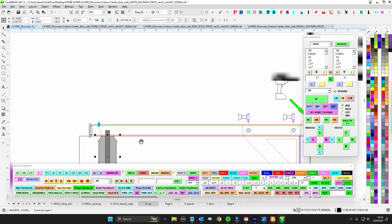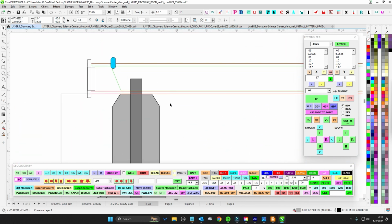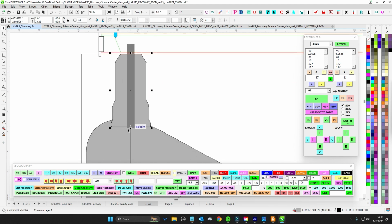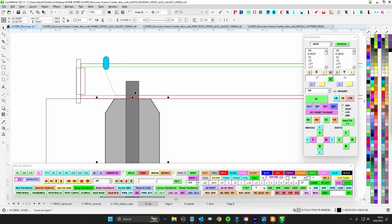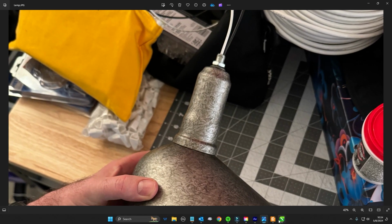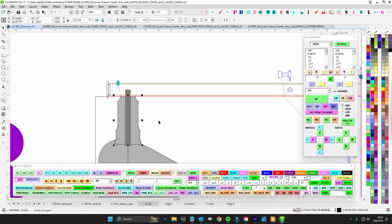There you go. So you'll see where you have the hole here. Then you're just going to push that lamp rod through, and you're going to sandwich that collar loose and make sure you're holding on to the socket down here. Push it up, and then you're going to take that star washer, and then that nut, and you're just going to sandwich it inside this thing. That's going to basically hold it all together.